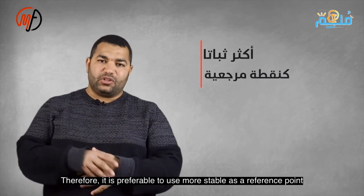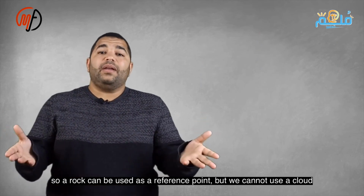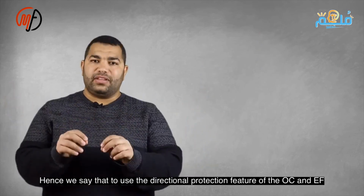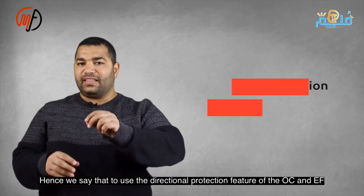Non-directional overcurrent needs only one input from CT. In directional cases, voltage is essential. In non-directional, it's only for measurement if present. Directionality is clearer through this phasor diagram, showing vectors VA, VB, and VC.